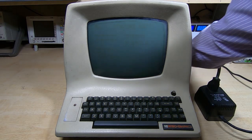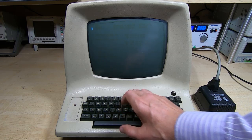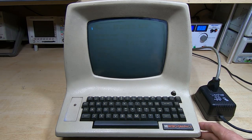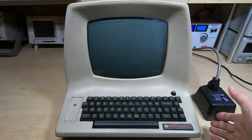We'll get the ADM turned on. It looks like it might come to life - really depends whether the tube is any good or not. We're getting something on the screen - a very blurred cursor, which may just be because the tube is very dirty. The brightness control works. It's not responding to key presses, but that may be because of the duplex setting - it might be expecting characters echoed back from the remote end of the connection. I won't leave it on too long as I don't know what condition it's in, so I'll reposition the camera and open up the case.